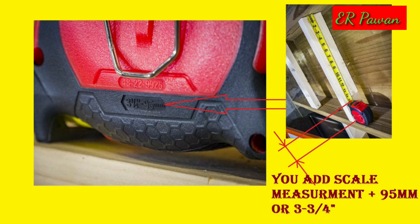Feature 7: Reading upside down. When possible, try to keep your tape measure right side up. When that's not possible, realize that the 59 inches you just measured may have actually been 65 inches, so double check. This goes double when you are adding fractions of an inch — if you're upside down, maybe you should be subtracting them instead.